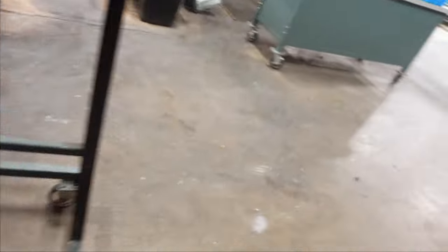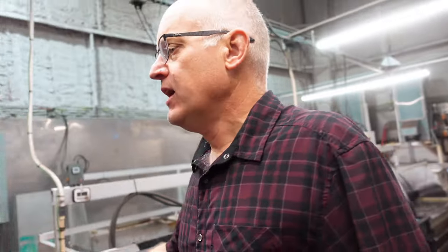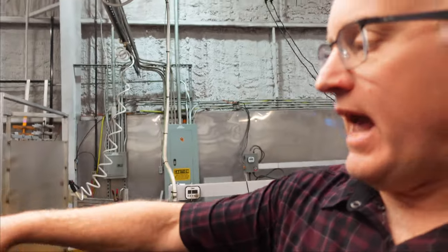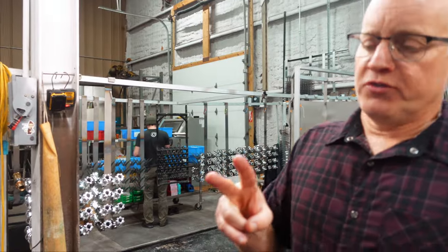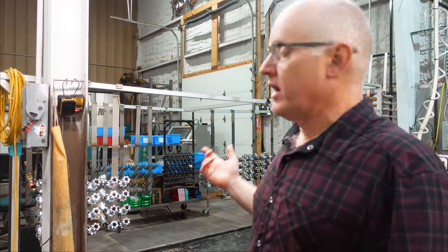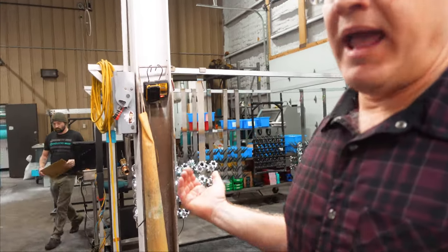Right now we're going to move on to the anodized stuff, and I'm really excited to see this because the anodized colors just make all the parts pop. Anodizing is one of the coolest things we do. We actually started anodizing ourselves when we first started Industry 9 — we outsourced to top anodizers around the country but they couldn't match the colors. Anodizing is an electrochemical process that converts the top layer of aluminum to aluminum oxide. That does two things: it makes the surface scratch resistant, so hits, sand, and rock won't damage it. It also makes the surface of the aluminum slightly porous so it can absorb dye. Anodizing isn't a painting process — it's a dyeing process, closer to dyeing Easter eggs.